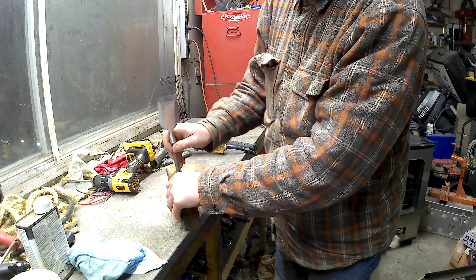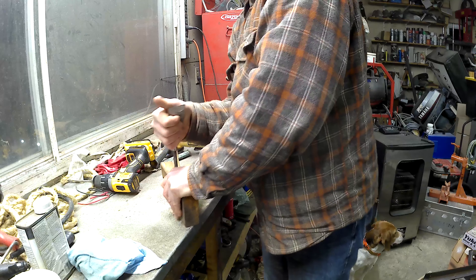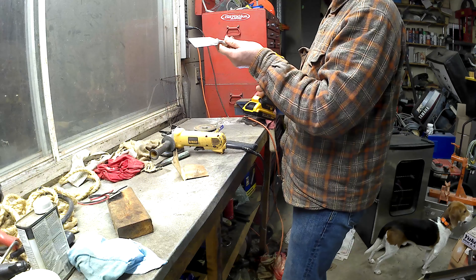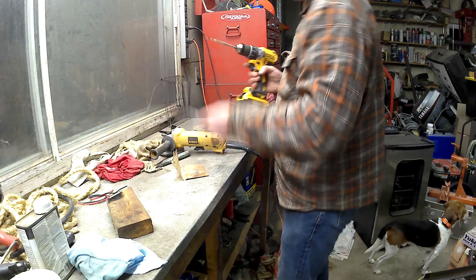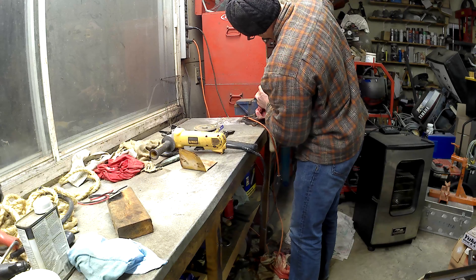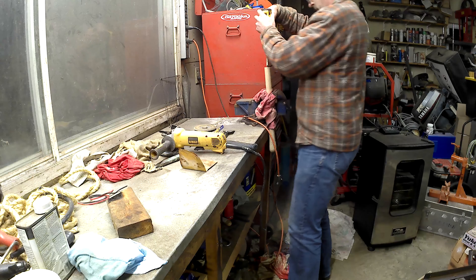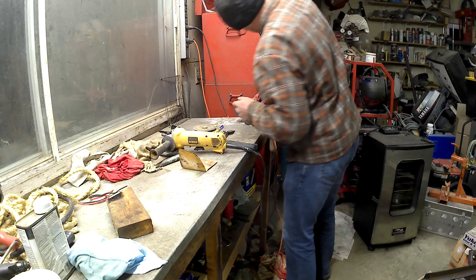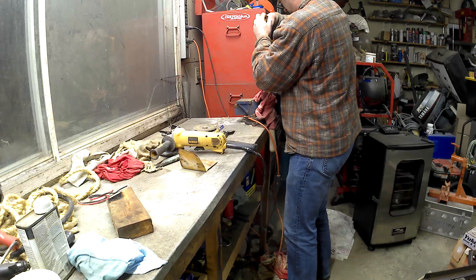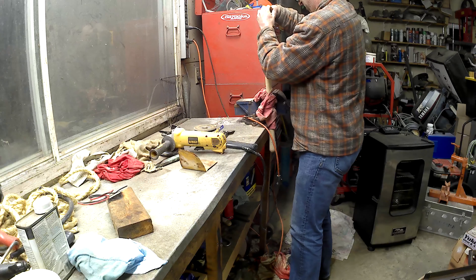I want to make sure that the drill bit I chose is going to be a good enough size and nice and tight, leaving some room to get some epoxy in around the tang. As you can see, this one works just about perfectly, which is great — it's the first one I picked out of the drill box. The tang has a bit of a hex shape to it so there's lots of room for the epoxy to get around it. I'm just going to drill the handle — following the quickie slicky rules here, I could align this up in a drill press but it's really not needed. This actually turned out to be just about perfectly straight, so it just goes to show you doing it by hand is just fine a lot of times.